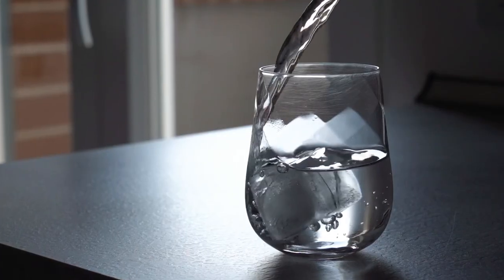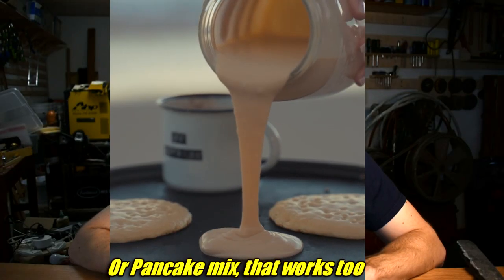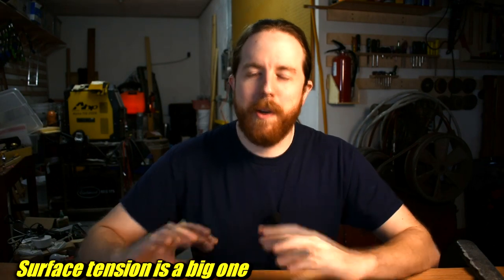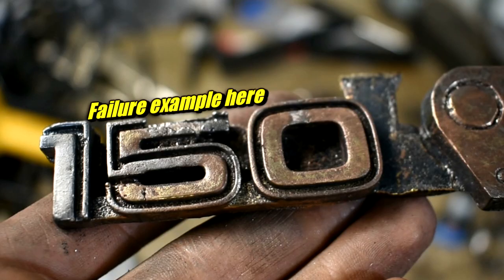This is important in metal casting, particularly because of the metal flowing. Think of water flowing, for example, versus motor oil in the winter. It's a big difference. They both flow, they're both liquid, they are not the same. And it's not just viscosity, there's other stuff, we're not gonna get into it, but the point is, it has to flow into the mold, conform into the shape, and get into all the little details before the metal cools off and freezes. Alloys designed for metal casting do that job better.